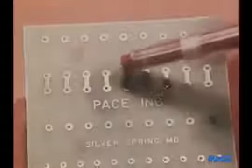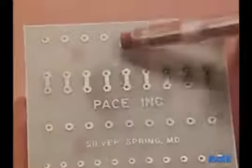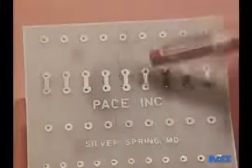It's done with a rubberized abrasive stick, which gets off all the heavy oxides from the lead surfaces. The pads are also cleaned with the abrasive stick. Any oil or grease should be removed with solvent before the abrasive and then again afterwards.